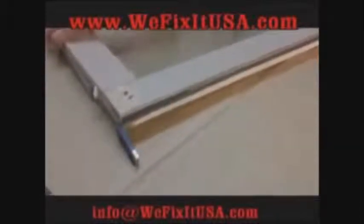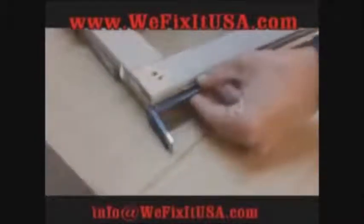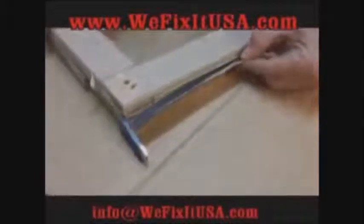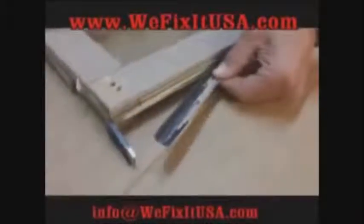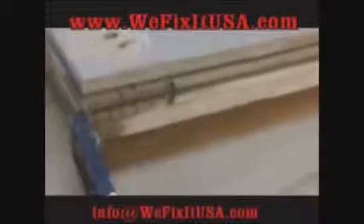There'll be more to come on that. Here's one of the first steps — we already did it on the other side and I forgot to show the detail: you've got to remove the weatherstrip. That's probably the very first thing you do, and you've got to be careful how you pull it out, because there is a very small kerf track cut in there for that weatherstrip.